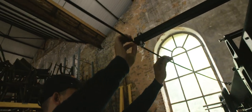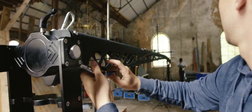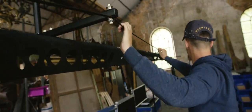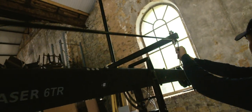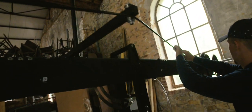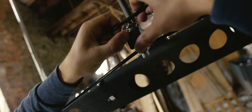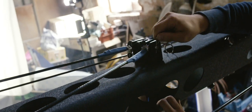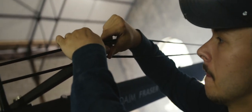Connect a 34 feet 2 cable to section 2 and connect it with section 13. Repeat the same procedure with another 34 feet 2 cable, towing it from the other side of the jib. Connect both cables of 27 feet 10 to section 2, attach the other ends to section 11, and align them properly with both sides of the horizontal cable guide rod.